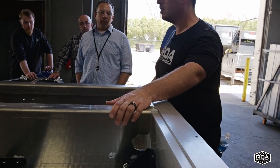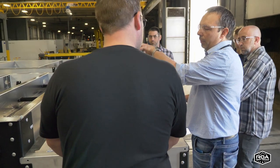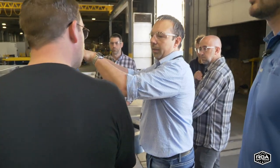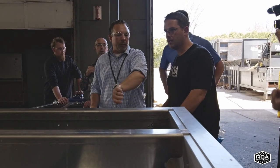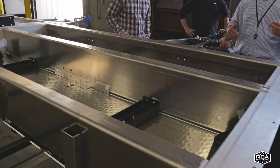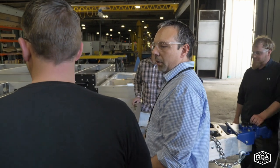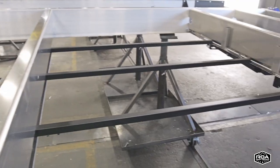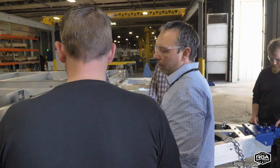That's also very helpful for manufacturing, because the way the engineers designed it, you actually drop stuff in. All these cross members, when they assemble, they drop them in and rivet them in, so they don't have to worry about setting height. That whole issue goes away entirely. We'll always be where we want them to be, and everything is already pre-drilled, so they just assemble.